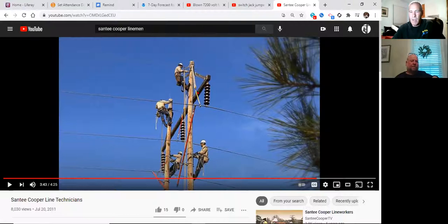Look where these guys are climbing — the sides of the pole. This guy's on this side, this guy's on this side. You don't want to work anything as close as possible — use the full stick in your process. This puts your body on the pole and closer to the phase that you're working on, especially in the center. When you're working transmission on this H structure, I would say this is probably the whole crew, with a supervisor on the ground doing the groundwork.